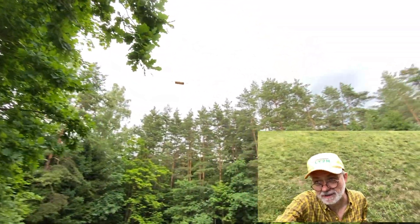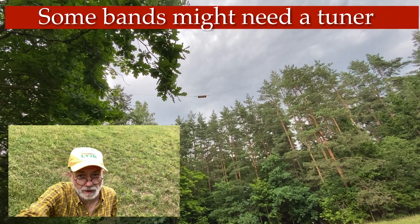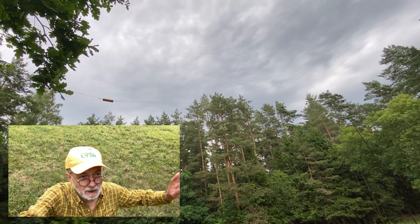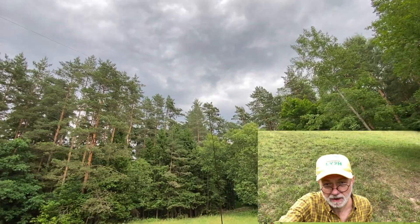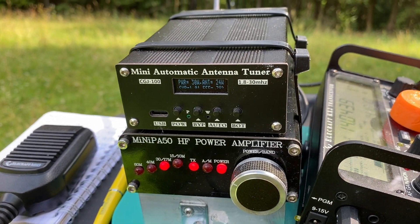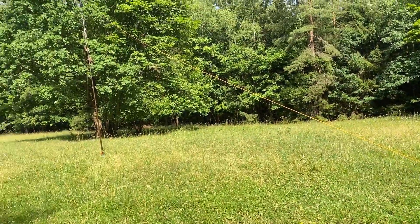It's a loading coil. According to some descriptions it should be 110 microhenries of inductance, but mine is clearly less — I think around 80 microhenries — wound of the same antenna wire with no joints. It's just one wire that goes as wire, then coils up, then goes as wire again. No pre-made problems with coil connections. It goes over there up to a tree limb. That's my favorite antenna. It works very well on 40 up to 10 meters, and pretty well on 80 meters.